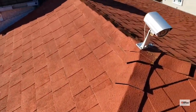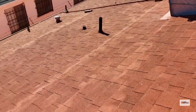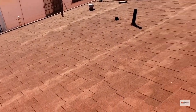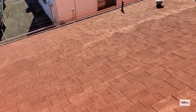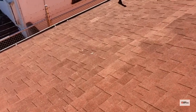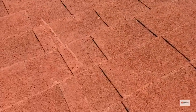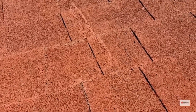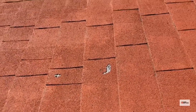Based on my best guess, the material may not be in terrible condition, but there's really no way to verify the true condition once it's been painted like this. There can be a lot of granulation loss that just doesn't show up, and the paint can also cause problems — especially where there's excess — as it can get into the seams and block drainage.